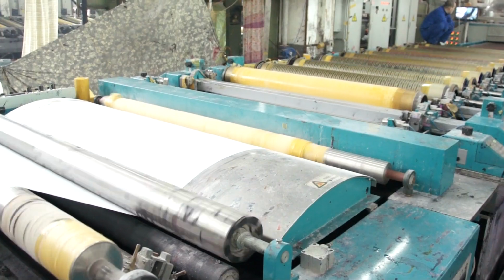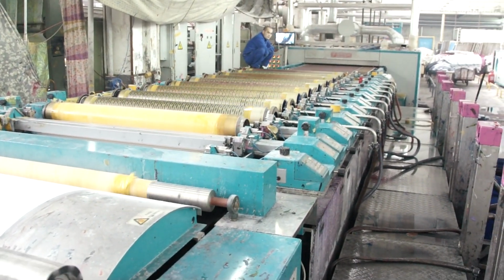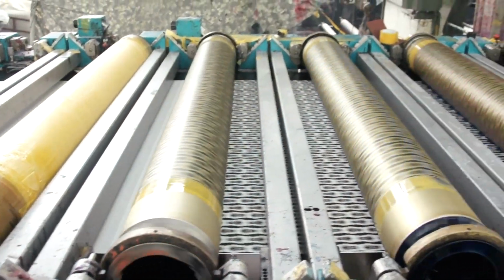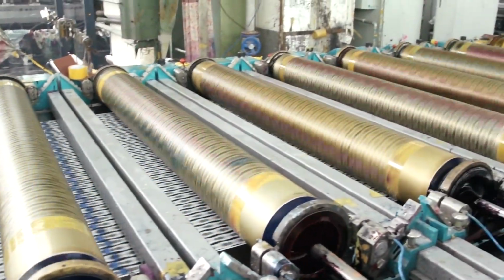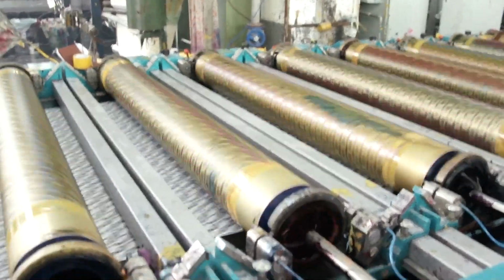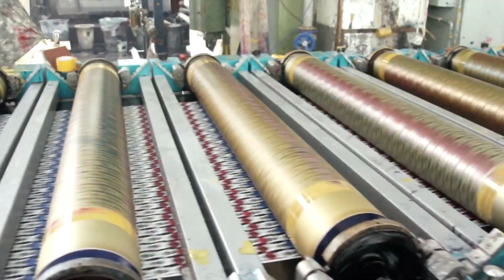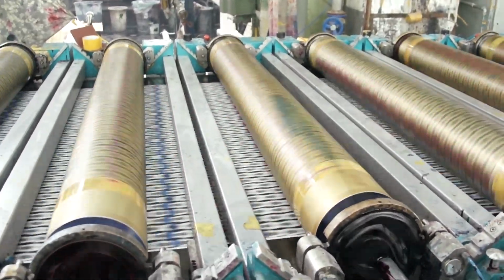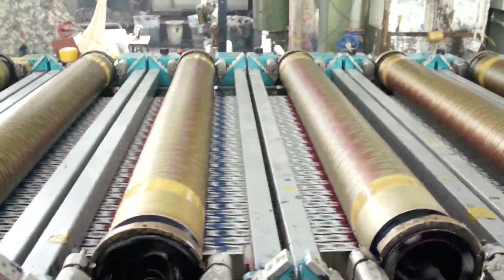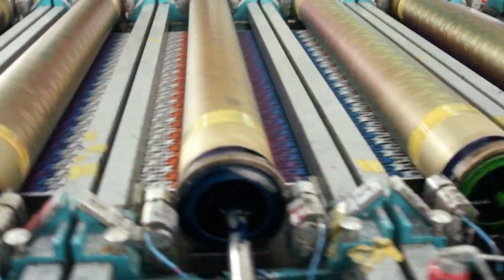Another type of printing is called rotary printing. Instead of a flat screen, the screen is rolled into a tube. Rotary printing is used for larger production runs and for designs that cannot be done on flat screens due to technical limitations. This rotary machine can print 15 colors and takes up much less floor space than a similar flatbed machine. The machine runs much faster than a flatbed and has a much higher minimum yardage requirement.